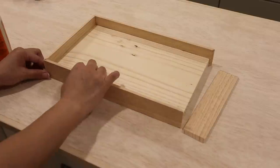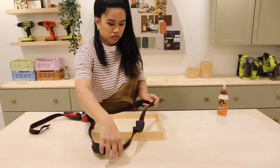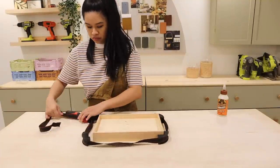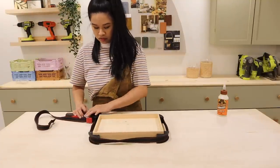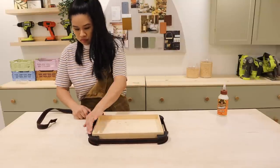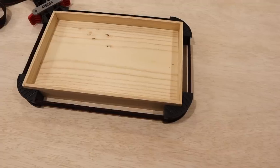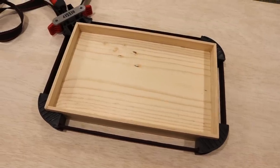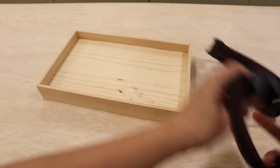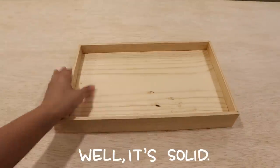When gluing it together I made sure to put the wood glue onto the miter cut edges as well — this gives you a really strong bond between the two joints so everything stays in place. I've actually had this strap clamp for a while but this is my first time using it. It's a great tool to have especially if you make a lot of frames and boxes — it keeps everything squared and clamped together and it's a little bit easier than using a whole bunch of clamps. Once everything's in place I tighten it so it's held together while the glue dries.